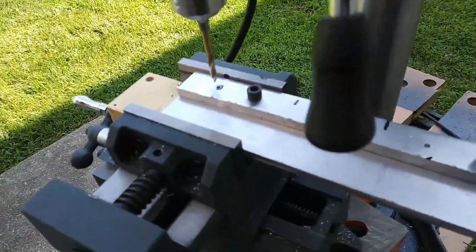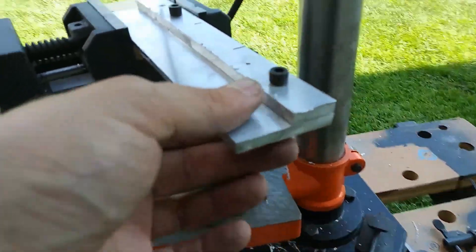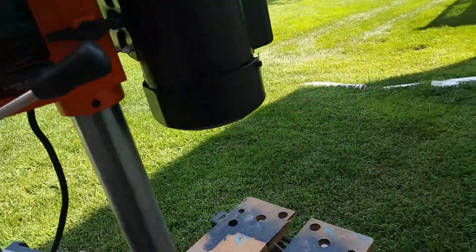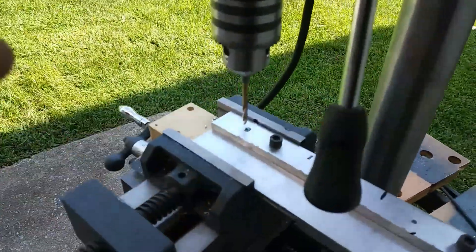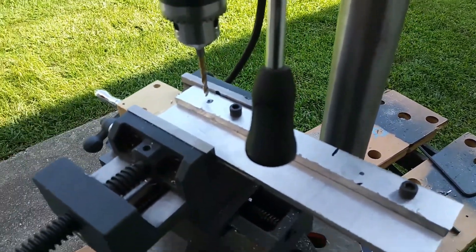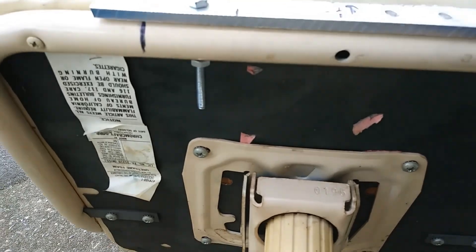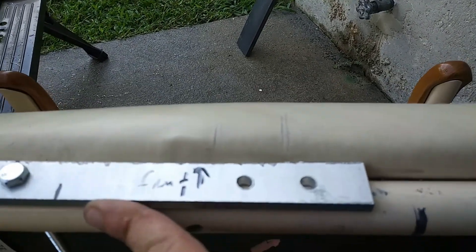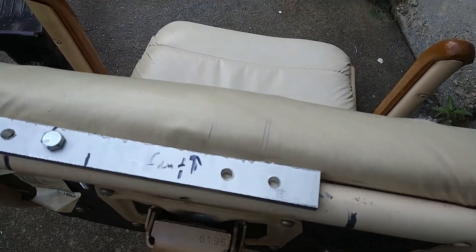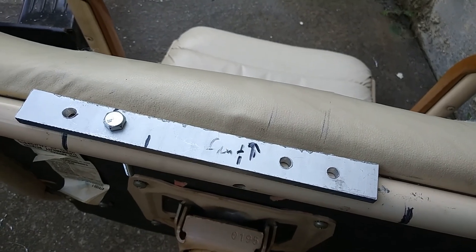So that's what it looks like with the two holes drilled. I stepped these up to a quarter inch and secured them so now I can clamp the other two and they're all guaranteed to be lined up right. Just make sure the orientation is set up correctly since it's templated rather than measured — if you flip anything around, those holes aren't going to line up anymore.